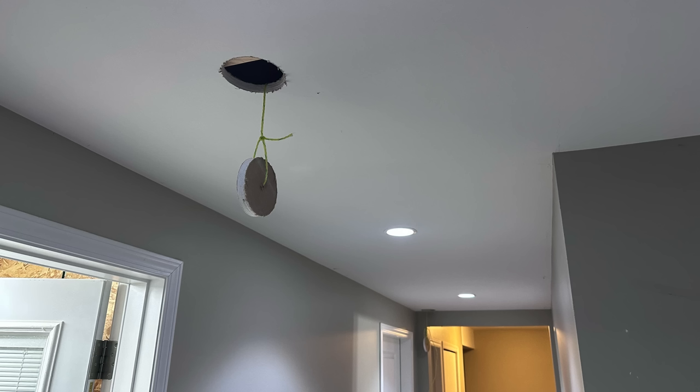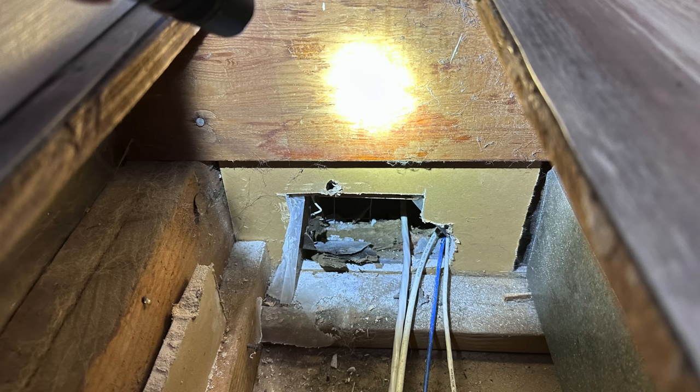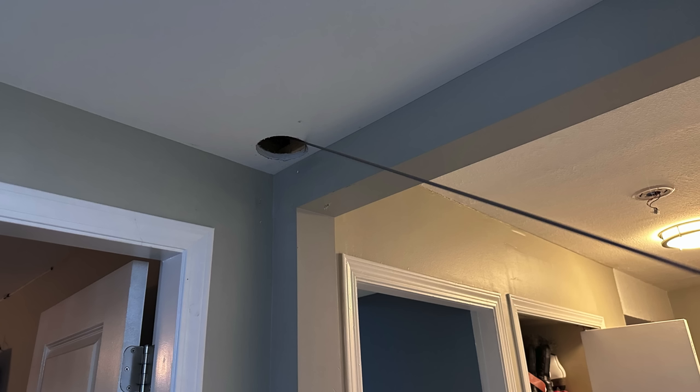I actually already got started last night. I'll put in some pictures here where I had to get some fire alarm wire down into the first floor hallway, which is a renovation that was done to the house, but it used to be an open carport, so I had to fish through an exterior wall and I had to fish down this hallway by pulling out the pot lights and pushing the light cans up in the ceiling and using fish sticks, fish tapes, multiple fish tapes, two people coming from different angles, long drill bits to drill through the side, and then I was able to get another one in the return air. After probably an hour or two of fishing, we finally have a line pulled, and that's where we left off and what we're going to be continuing on today.